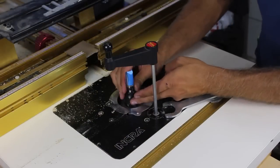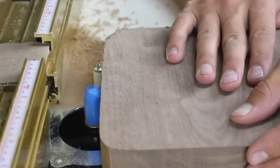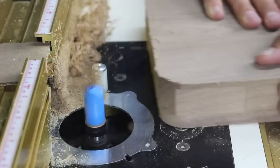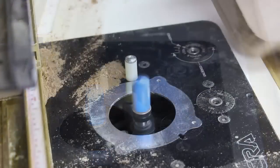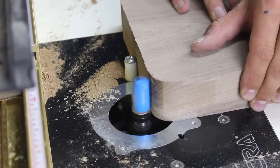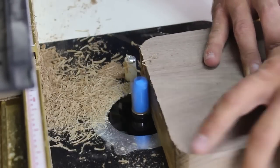I installed a half inch shank flush trim bit in my router table and used slow methodical passes to remove the material and make it flush to the CNC portions. Using a starting pin is a must. I pivot the workpiece off this pin to avoid catching the router bit and being pulled into the blade or thrown out of my hands.